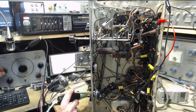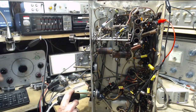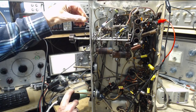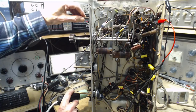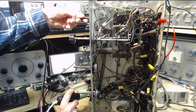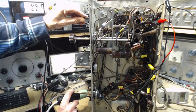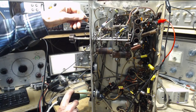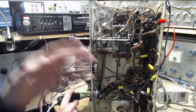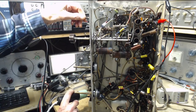Goodness. Tune. Wow, okay, so it would appear to be lots of signal now on the volume control. Look at the alignment. Watch my hand tune and just listen to how many peaks there are. That's bad. That's plenty bad. Those aren't just a little out of alignment. Those are in two different lanes. That would drag the radio down.